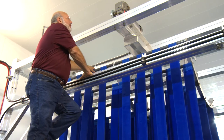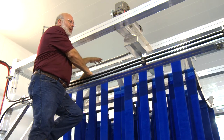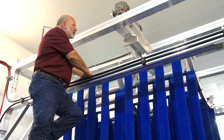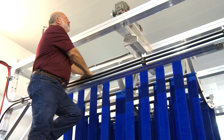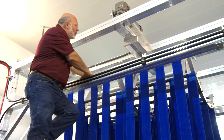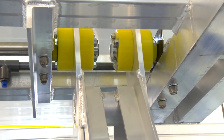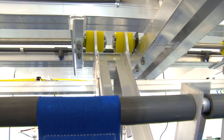When the mitter is all the way to one side, it's loaded to one side and you're never going to be able to move it with that wet cloth. The only way you're going to see that kind of play is to move it when it's centered. The little movement you see in the worm gear of the motor is normal. The other place to look is on the bearings on the shafts themselves — if they get sloppy, you'll see it when it's in the rest position.